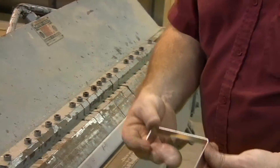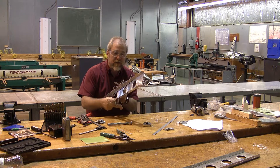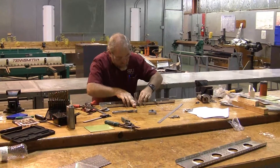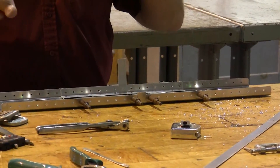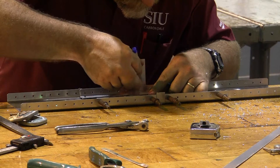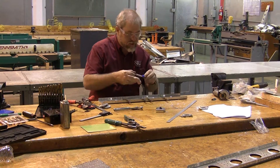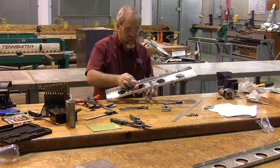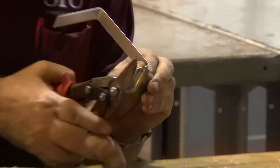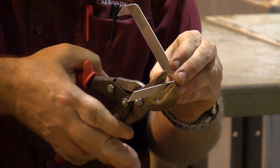That piece should just exactly fit our spar if I did it right. And our piece does in fact just fit our spar, just like we said it ought to. I'm going to hold it down on the table, make sure everything is pressed into position, and I'm going to mark where we need to do our cutoffs — mark this side, mark this side. I'm also going to mark where this fits on the spar, just so I don't have to play the puzzle over and over again. I'm going to take my snips and snip it right off on that line. You can always snip it a little shorter, but it's hard to snip it back longer again, so make sure you've got it correct.